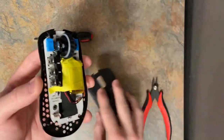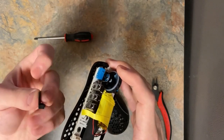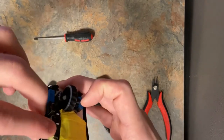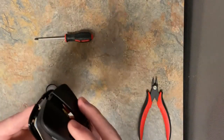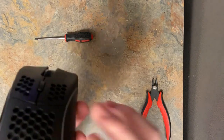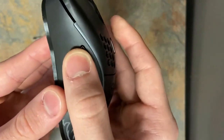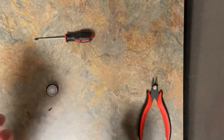Oh, duh, I forgot. The side buttons aren't working, so you have to throw these little printed side pieces on the side buttons. You want the back and the front side button. Once they're on, make sure they're as down as they go and as in as they go. Cool. So now it's all flush and everything. And the DPI button's not going to work because we cut that, obviously, and that doesn't line up.